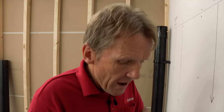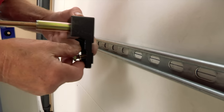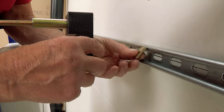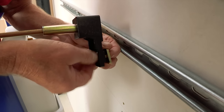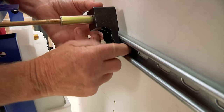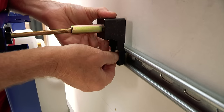To show how this clip fits into the unistrut: there's a nib on the back of the ABS bracket that sits in the groove. To lock it, you've got a washer that spins around — it must be the right way so that when the nut turns it tightens that washer on. Do it up hand-tight, then spin it round and tighten it.